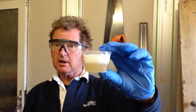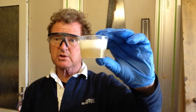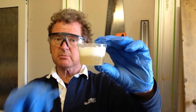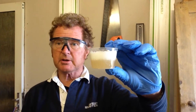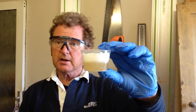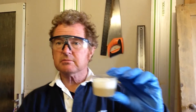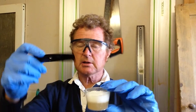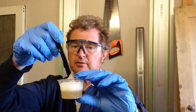You can see here I've got my mixed epoxy and I've got my 406 colloidal silica. I'm looking at about 1 to 1 by volume to achieve peanut butter consistency. I'm going to mix this together with one of our plastic mixing sticks, and I'm going to use a technique that I just call chopping in the filler.